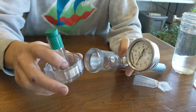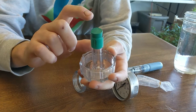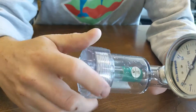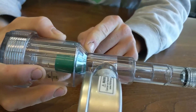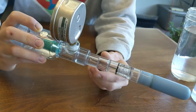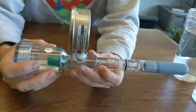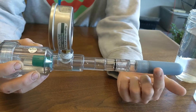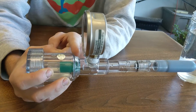Lastly, you just put this cap in and you can see that there is this green rubber stopper here. When you put this in and screw it closed, the rubber stopper makes a seal right here. This stopper separates the sensing body of the tensiometer and the top reservoir portion. This is the site of where everything is going to be going on in terms of a vacuum being pulled through here and the gauge reading it. This top portion is totally cut off.